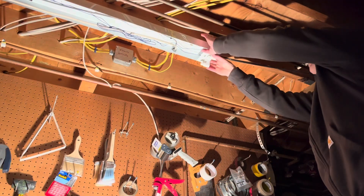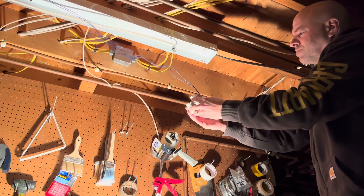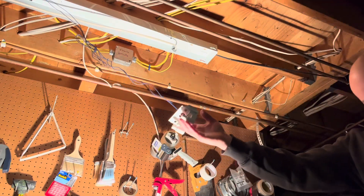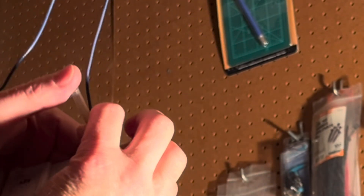Before I can remove all the wires, there is one small piece of sheet metal in the center that I'm just going to pop out and set aside. Next, I'm going to remove the bulb holders on the right — bending the frame up a little bit and then popping out that right end, slipping those wires to lower that whole bulb bracket. Once I safely step off the ladder, there's a hole right next to the blue wire, so I'm going to slip a very small screwdriver into that. That will release a metal mechanism that allows me to pull that wire out.